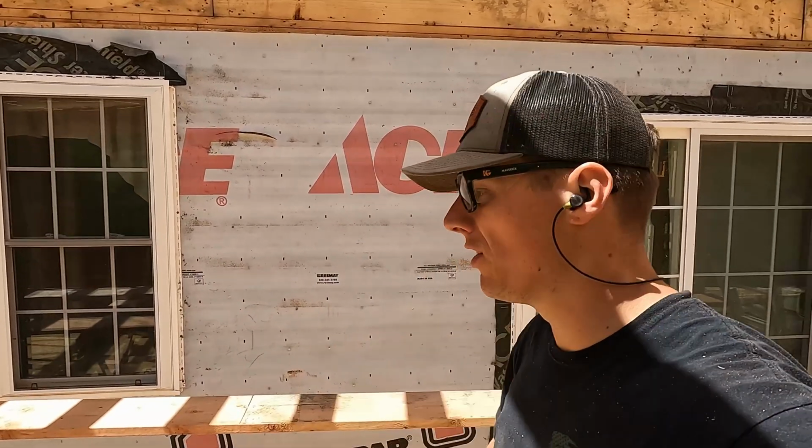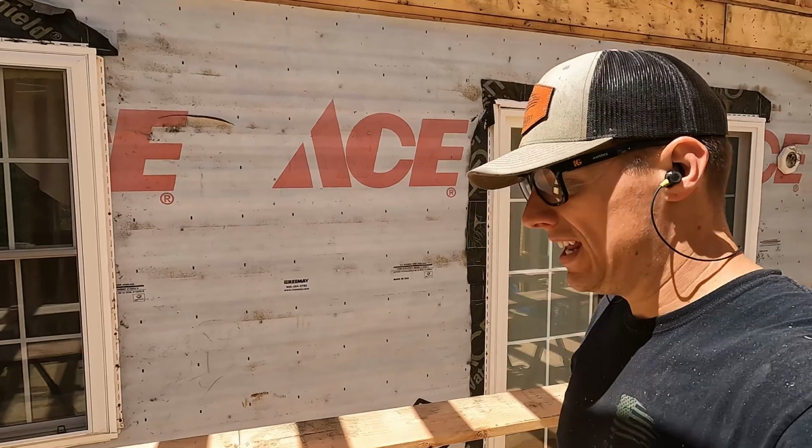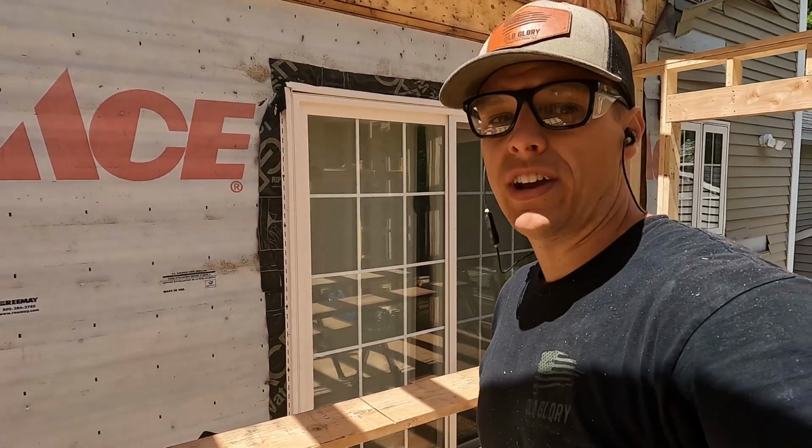I'm gonna make sure my rafters are plumb because you have a little bit of curve or they sit sideways a little bit. We'll just straighten them out while we're up there using a square, put it on the double top plate, straighten it out a little bit. I already measured and cut where I am going to land on the rafters, and I went ahead and cut that here, and then I used my roof gauge, 10 degrees.